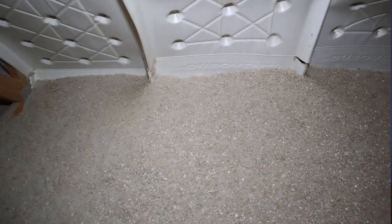Then there's cellulose insulation, and I think that's what the vast majority of people use. It's made from usually 85% recycled material. The nice thing is that it actually compresses a little bit — you spray it into your attic at a certain thickness and it'll probably lose about an inch as it compacts. That compaction actually gets it dense enough that it stops air infiltration, so it acts like a good air barrier up in your attic. It's also a great insulation that can be sprayed over existing insulation types — whether batt or fiberglass — you can cap it with cellulose. There are a couple of other types like mineral wool or polyfill, but those aren't nearly as common.